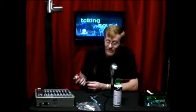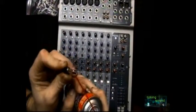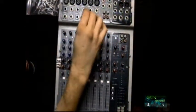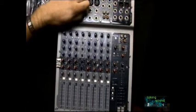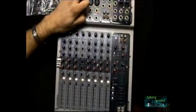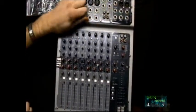Give your DeoxIT or lubricant a good shake and then spray it right onto the tip — just square onto it. Once you have it good and lubricated, nice and greasy, take your soundboard input and pop it right in there, then give it a good twist around to make sure it's hitting all those contact points. I really wish I had a contact microphone on that because when I first started turning it I could feel it and hear it gritting around, and now it's just clean as can be.